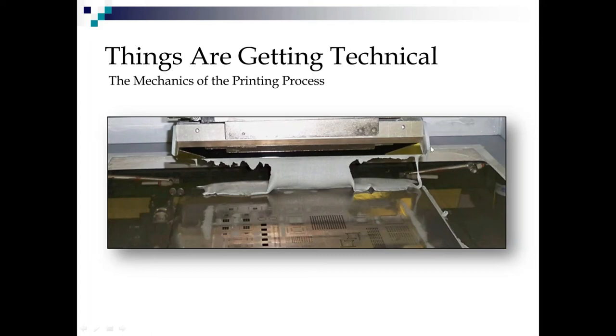What you see on the sides here are little paste catchers, so we don't get too much paste out on the edge of the print area. But one of the reasons this looks so beautiful to me is the way the paste is curtaining off the squeegee. When it comes off the sides and runs towards the middle and drops down and leaves a fairly smooth edge like that, that's art. That's poetry right there.